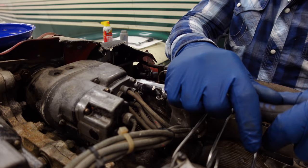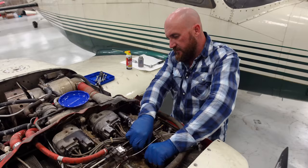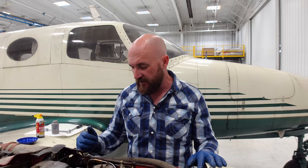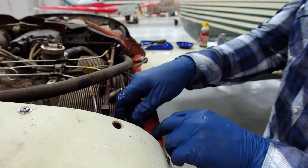At this point I'm thinking it has to be a fuel issue, not to mention I'm sure it doesn't have perfect compression — there could be a few stuck valves. So we'll pull the plugs out. The other thing we could check is whether the mag switch isn't working — maybe it's constantly grounded out or there's a bad wire. We'll pop the plugs out on both sides, pull all the leads off so it can't fire, turn it over, and check for spark.